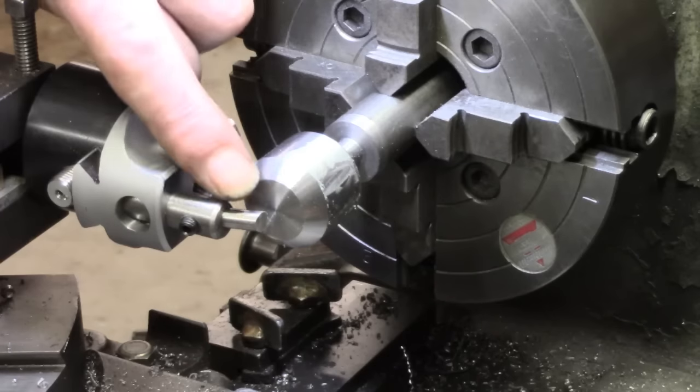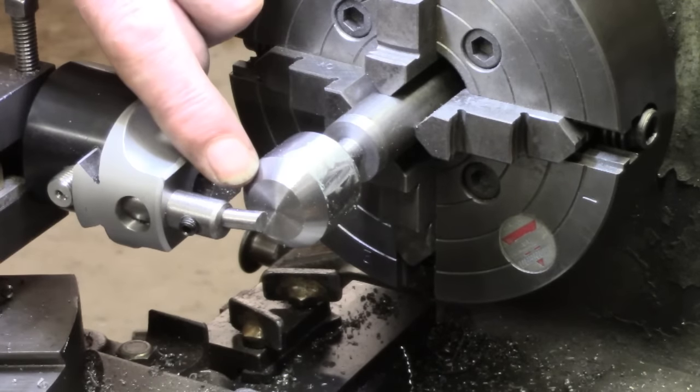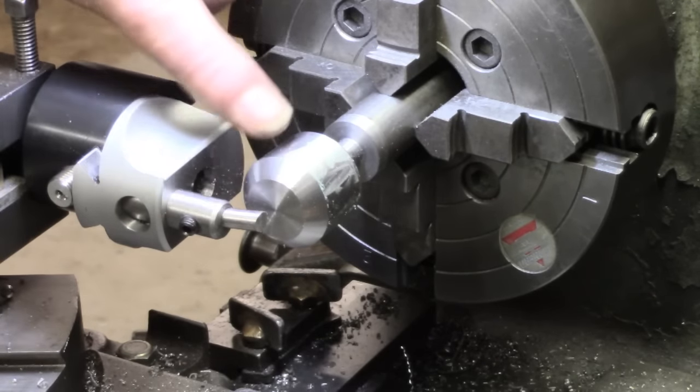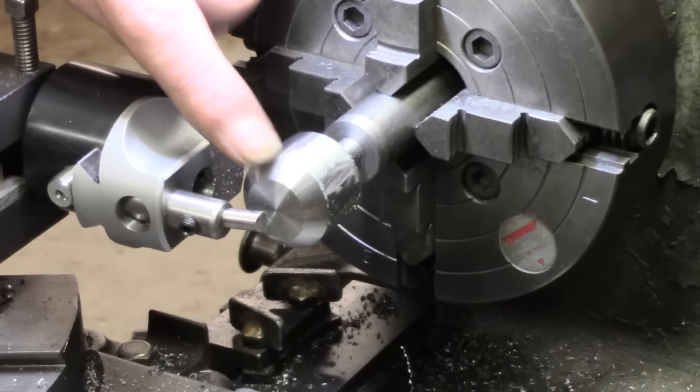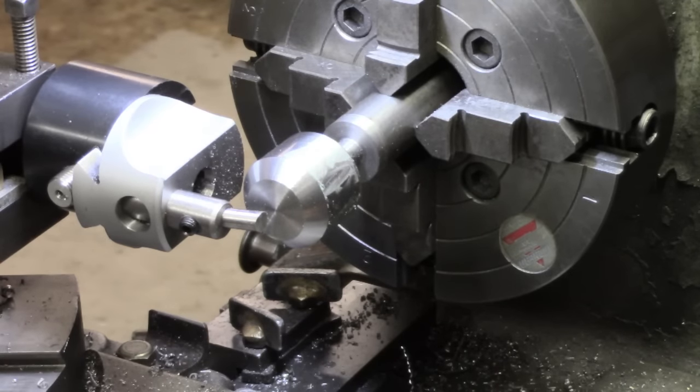But the material that's coming off the tool, I quite like the behavior of the chips. It's obviously a reasonably good cut in essence. So we'll see. Probably going to be more chatter. In fact, although I'm liking the anchor lube, I've half a mind to set up the oil drip just to get some lube on this side. I'll think about that.